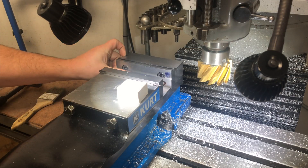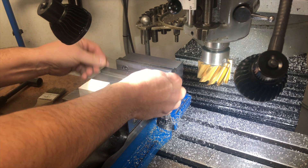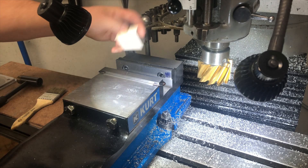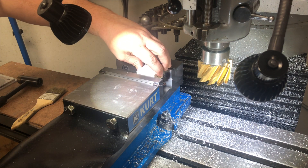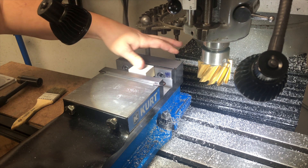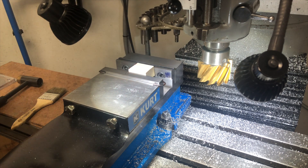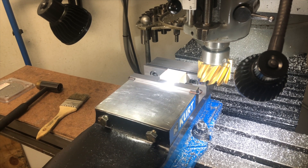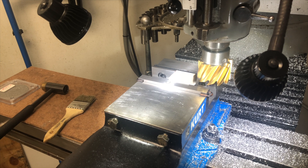So we're putting a small parallel in. I have my wire bent so it just kind of hangs on the jaw. What we're going to do is we're going to face it — square it up — and we're going to face the biggest face. I got my big shell mill loaded up. It's high-speed steel, ridiculously sharp, and it is going to go through this plastic like no one's business.